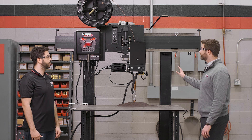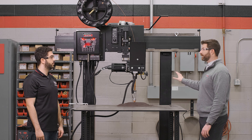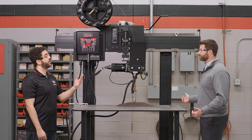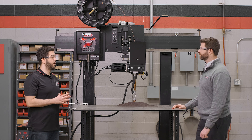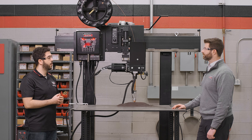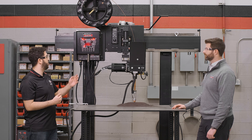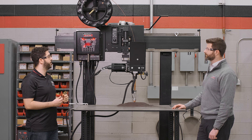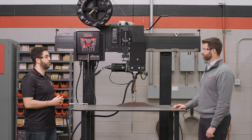Now Sharif, let's say I'm an educational facility that just purchased the Classmate Trainer. How easy is it to install and how does it ship to me? That's a great question Wyatt. Everything arrives on skids and in terms of installation, it's fairly straightforward. You assemble the main two legs, you attach the side beam, then the TC3, then your lifters and your weld heads, then your reel and your controller. Everything attaches piecewise and all the bracketry and hardware you need is provided.